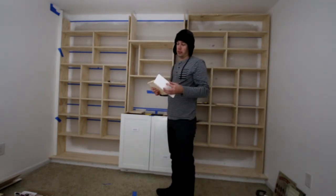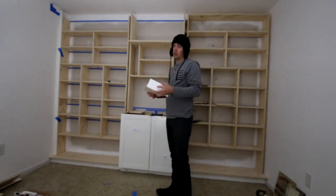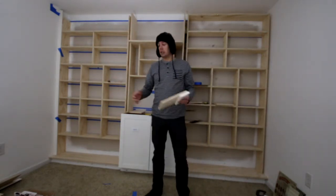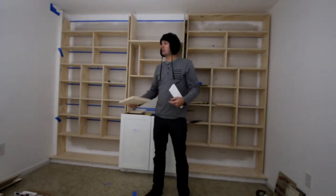And then once I clamped the aluminum guide down, I took the one off from one side and put it in the middle. And I wasn't able to clamp the middle of the rail because it's in the middle of the plywood. And so I took a flat piece like this and I put two screws in it and basically screwed it down to the wood.